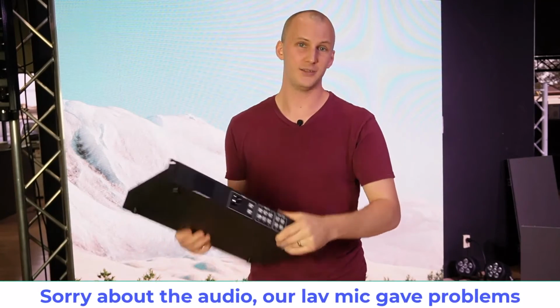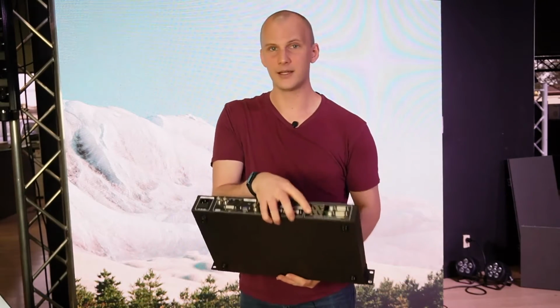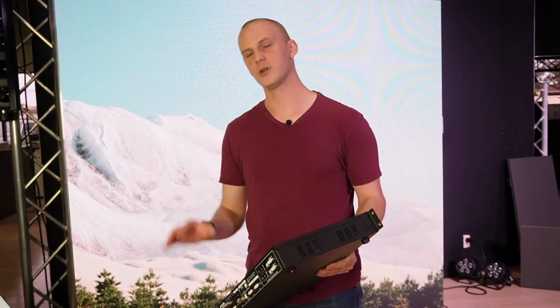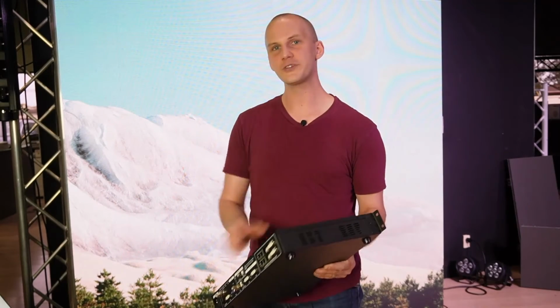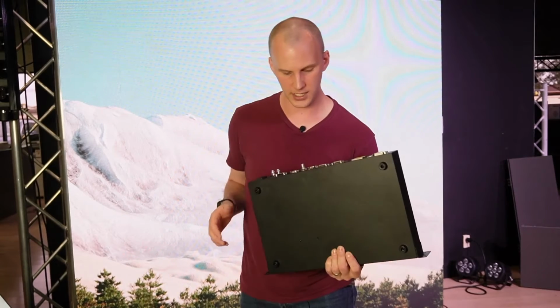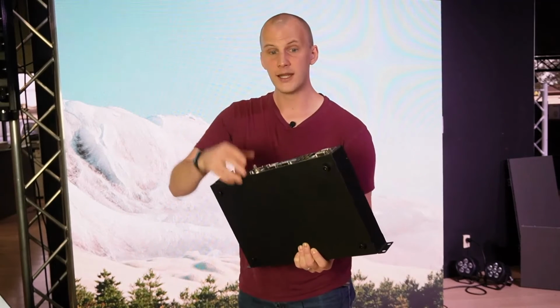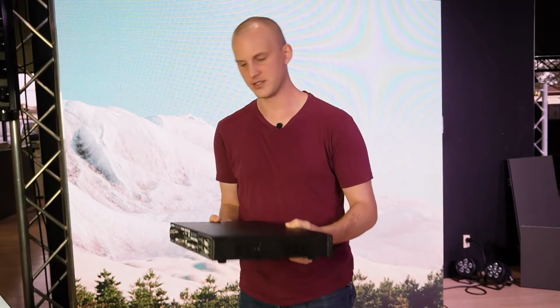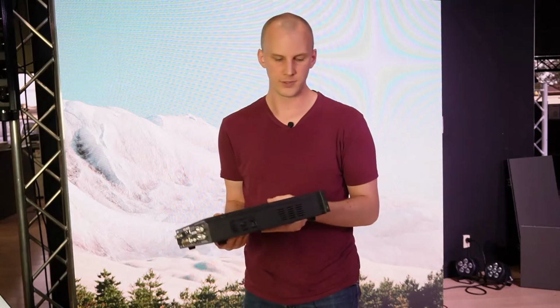So you get a processor. The processor is going to have Novastar cards in the back of it that send out to your panels. It also generally has a video switcher, so you can bring in multiple sources, like this one has SDI, HDMI, DVI, VGA. You can bring all those in, output it from the processor side to the Novastar side, or some of the Novastar branded processors do that part internally. Okay, you can also scale your image, etc.